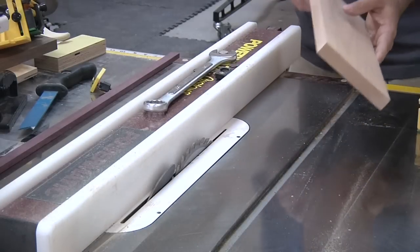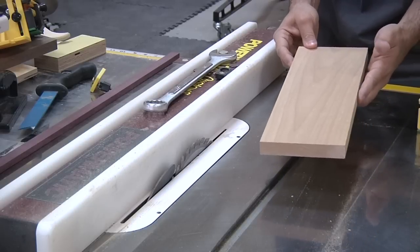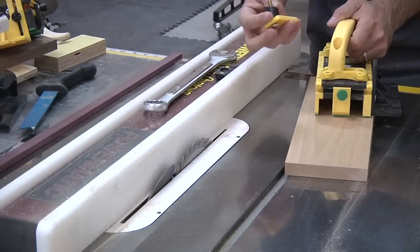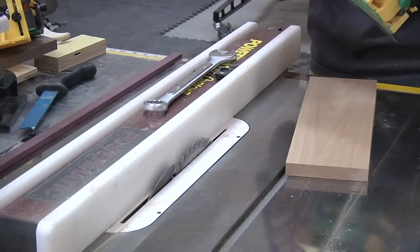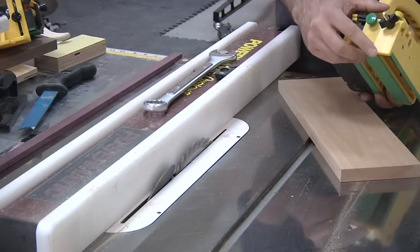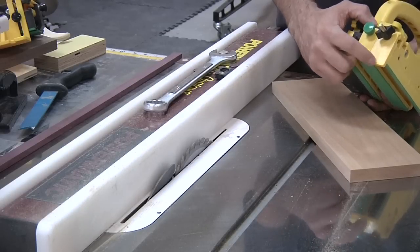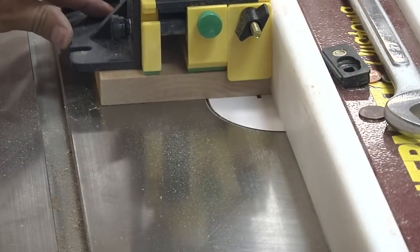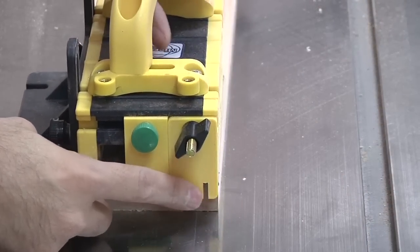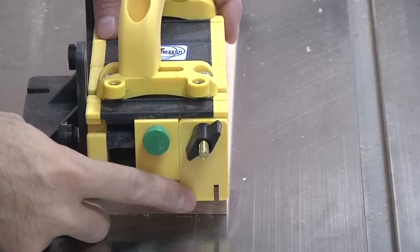If you're cutting a really dense hardwood — in this case it's alder, not very dense and not too hard to push through — but if it is proving difficult, you may find a little extra security would be nice. That's where you can use this hook. I consider this hook to be sacrificial; you may want to buy a couple for different operations. As the blade passes through, it cuts a little zero-clearance kerf in there for us. But if you're making a lot of repeated cuts, it's well worth it because it'll be that much safer. Even though I have this kerf here, no matter how many times I make this cut, I still have support on both sides of the blade to push those tiny pieces through.